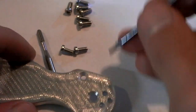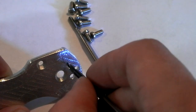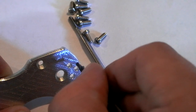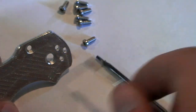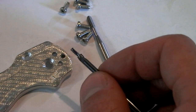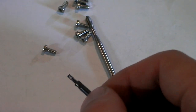So this is a thread mill — think of it basically like an end mill that cuts threads. You drill your hole in the material, the thread mill goes inside all the way through, and then it's spinning. It interpolates out in a circular pattern while pulling out, so as it's pulling out it's pulling out in the same pitch as the screw thread, and it just cuts the threads. It only needs one rotation plus a little bit of overlap and then it's done. A thread mill happens way faster — it just goes in, around, out. So if you're doing a lot of holes it's faster, and it's more accurate because you don't have to use the spring-loaded holder. You can see it's totally square on the end and there's threads all the way to the bottom, so you can do a completely blind hole right to the bottom.